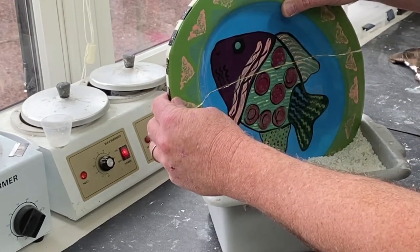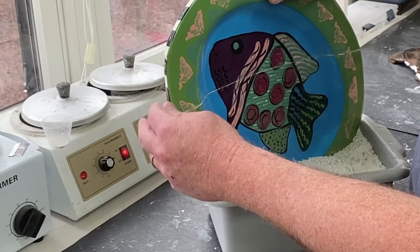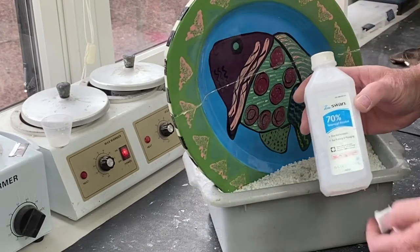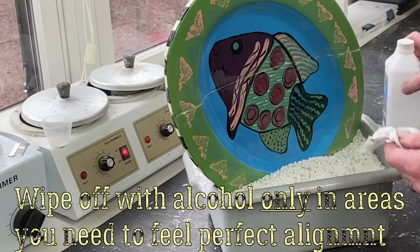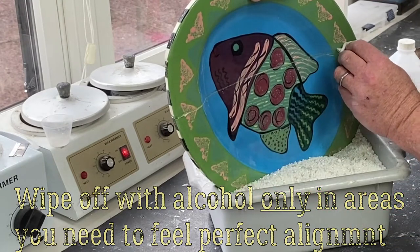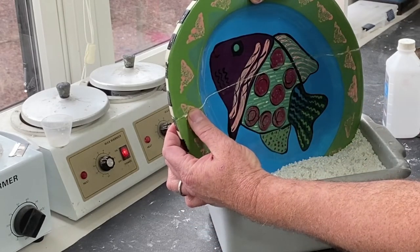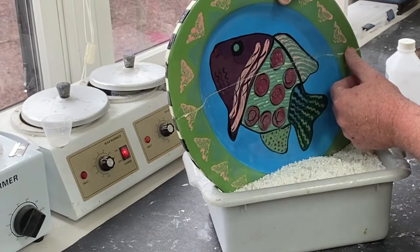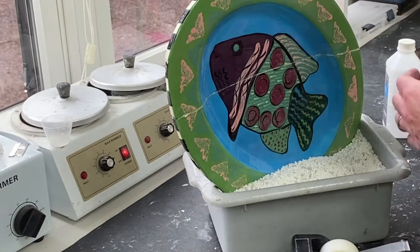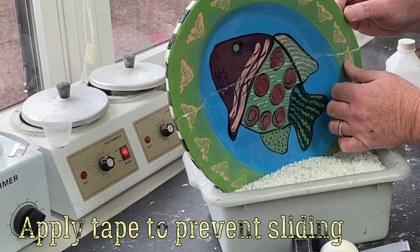You can use resin. When you place and squeeze it, make sure you don't wipe off the glue — it's going to make a mess and be much harder to remove. Just clean the areas where you want to check alignment. We're using 70% alcohol; 91% is better but hard to get. Use scotch tape to make sure it doesn't shift while it cures.